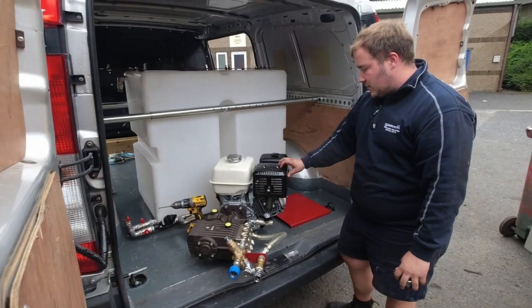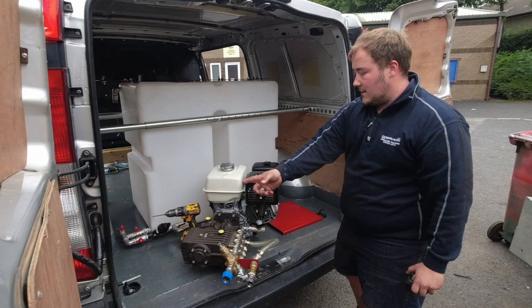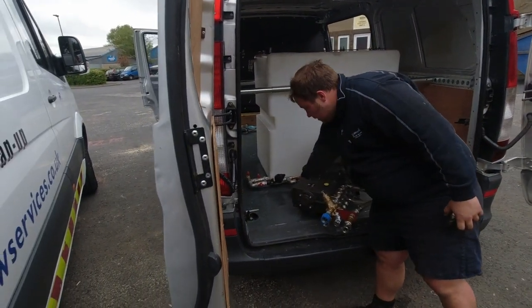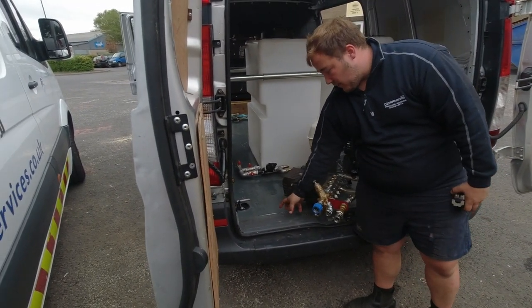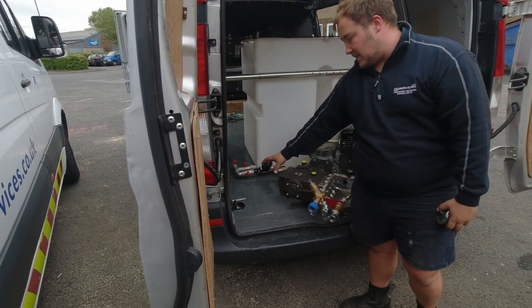So this machine, the exhaust fumes want to be facing out, you want your primer and frost valve facing out, your pipes running this way and round into your dual feed setup, which you can see here. Next thing we're going to think about is obviously the boiler at a later stage, maybe not now, but at a later stage for moving on to hot steam, once we've mounted somewhere around here. So you want to leave that space there.